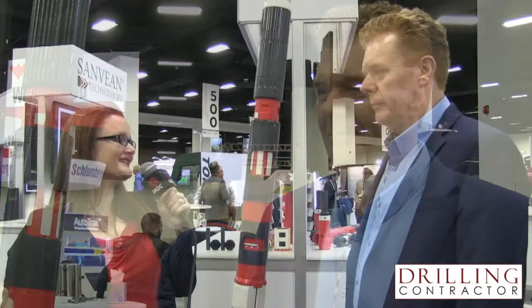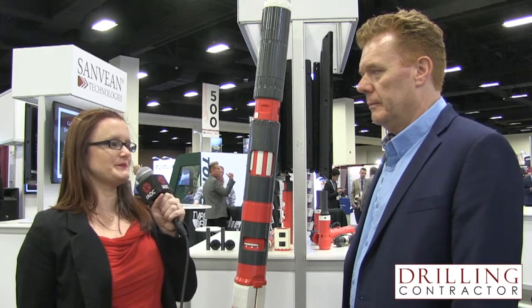I'm very good, thank you. The RSS combines a mechanical foundation with digital controls. Can you tell us about the new RSS and the benefits of having both mechanical and digital capabilities? Well, the new digital RSS is built on the foundation of a mechanical vertical drilling tool. Scout Downhole had this vertical drilling tool for a number of years, covering over 5 million feet in North America and over about 100,000 hours of operation. We've removed the mechanical control system and added a new digital control system into the tool, which allows us to nudge and maintain low-angle tangents while drilling from pads in North America land.